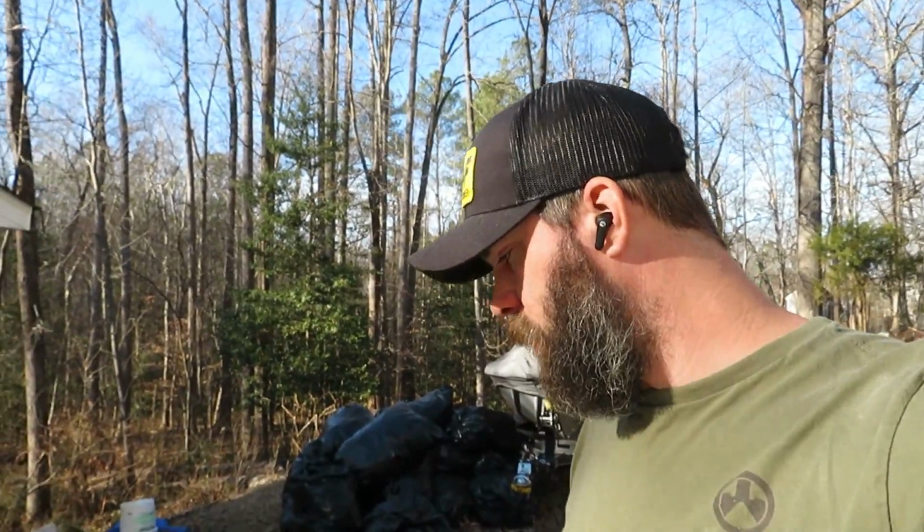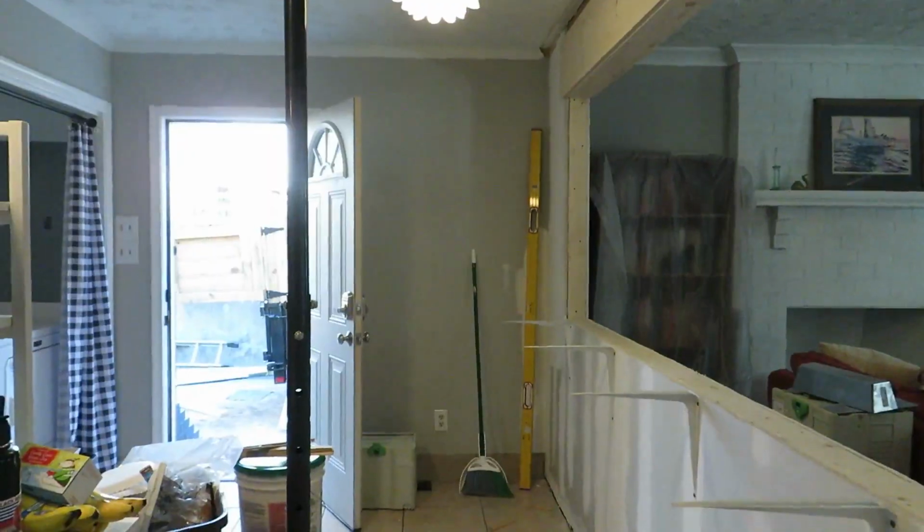And then I will move it into the basement at some point this evening and fill all of the little holes, anything that needs filling, with stainable wood putty, and then let that dry overnight. I will go test fit it before that. I'm about to use a laser to get the top of the wall where it's going to sit nice and flat and level, and also install the brackets that will help support it, so that I can just drop it in there and test fit it one more time before I do the sanding and staining tomorrow. That's probably as far as we get for today, so I'll check back in on that in a little bit.